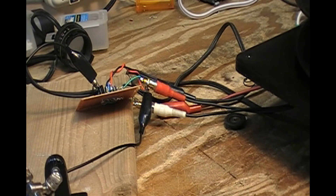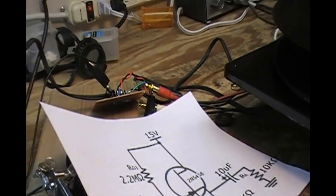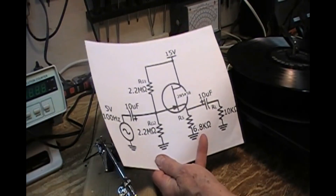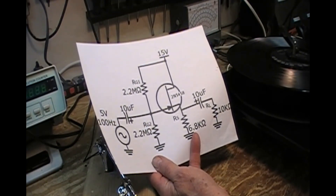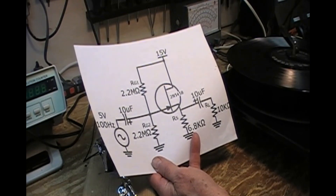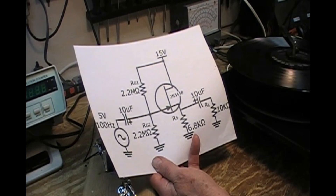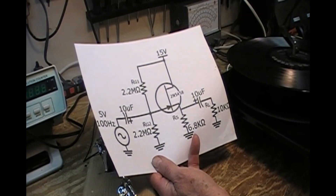I've tried many circuits, and this is the one I chose to use, basically because my preamp will be using integrated circuits that run at plus 15 and minus 15, and this happens to run at plus 15. It doesn't have any kind of compensation for the response of the crystal cartridges, and it is a bit bright, I have found.